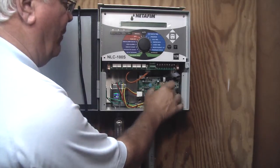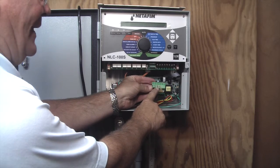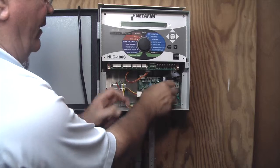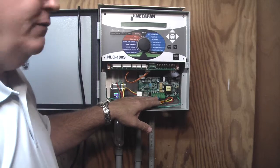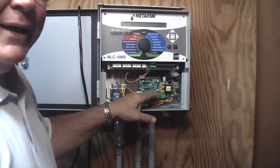The four-wire path coming in — you'll notice I have R, Y, B, and G: red, yellow, blue, green. Mark those. It's the first four terminals. You'll notice that this terminal comes out after I install it with the wires connected. I'm ready to go out into the field and make sure I follow that wiring path all the way back to the controller.